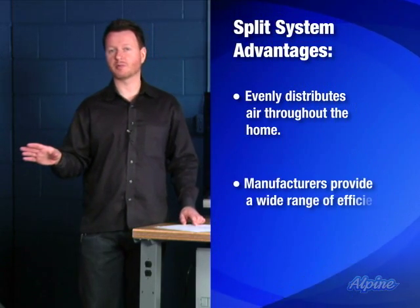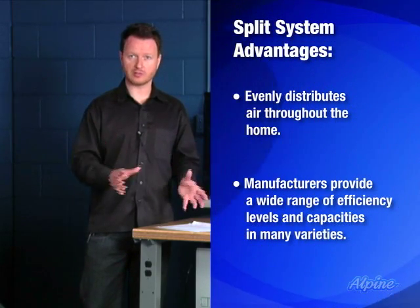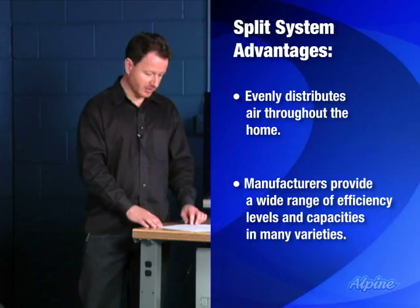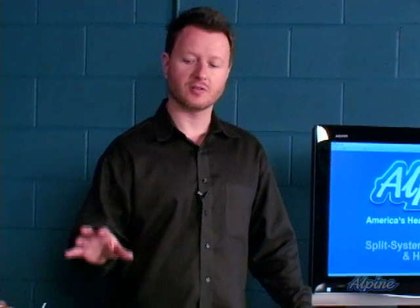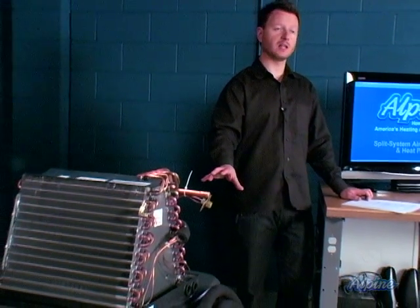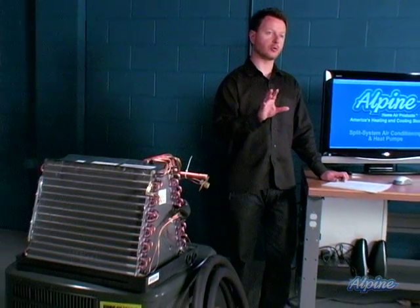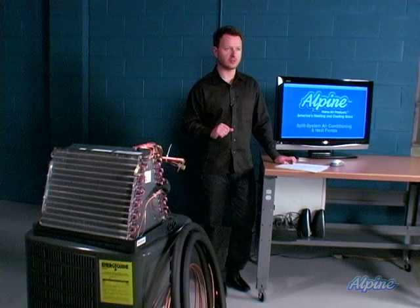Also because they're so popular, manufacturers make split system equipment — both indoor and outdoor — available in a wide variety of choices in both capacity and efficiency. Can you install it yourself? Well, you certainly may. If you're a handy person and feel qualified, you can do 90 to 95% of that work yourself. An important thing to note is that you can't handle the refrigerant if you have the type that uses R22. There's a second type available using a newer, more environmentally friendly refrigerant called R410A — if you purchase that type, you could technically do 100% of the work yourself with no special license needed.